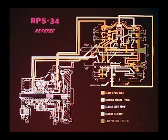Pressurized oil is directed from the selector spool into the C2 pilot circuit, which is routed through the C2 shuttle valve and the opened C2 retard check ball. The C2 pilot is actuated, permitting pressurized oil from the supply gallery to pass through the pilot and into the C2 clutch.